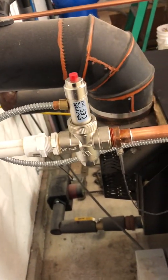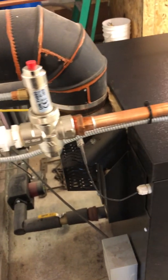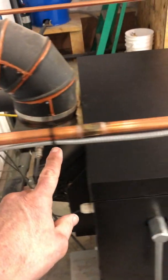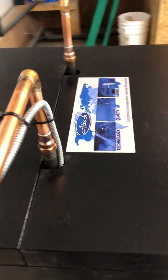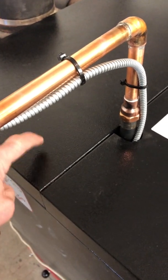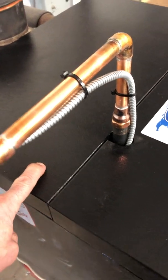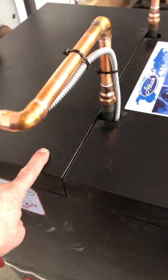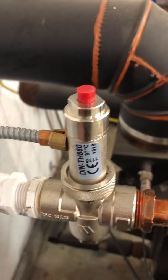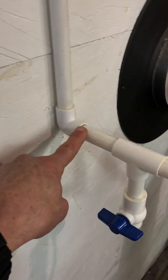The way it works is you use a Watts STS 20 — it's a thermostatically controlled valve that requires no power. There's a sensing element with copper tubes that are routed into a port in the boiler where you install a thermal well, basically right under here. It requires no power to operate.